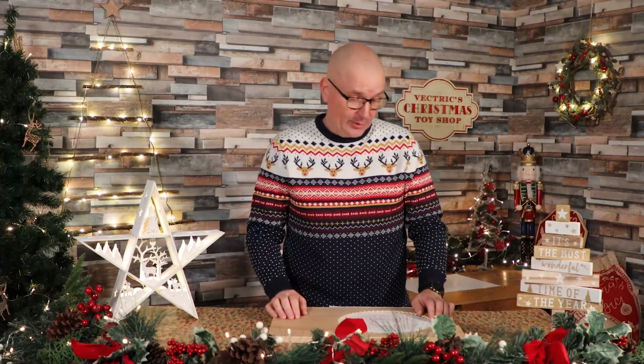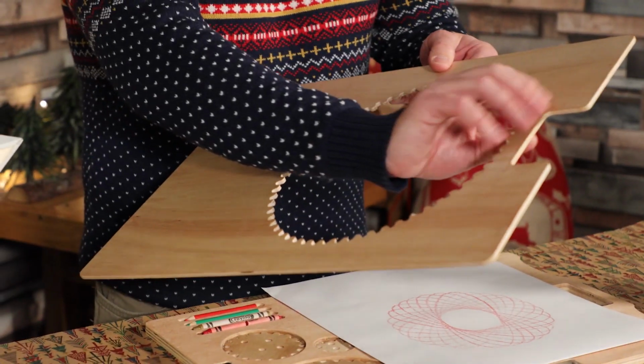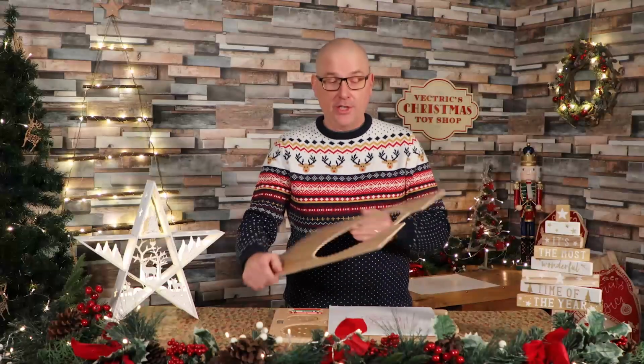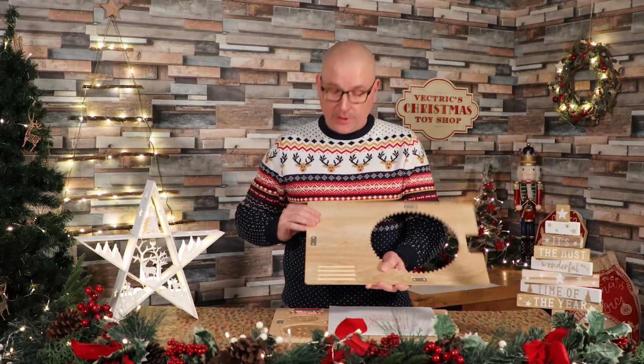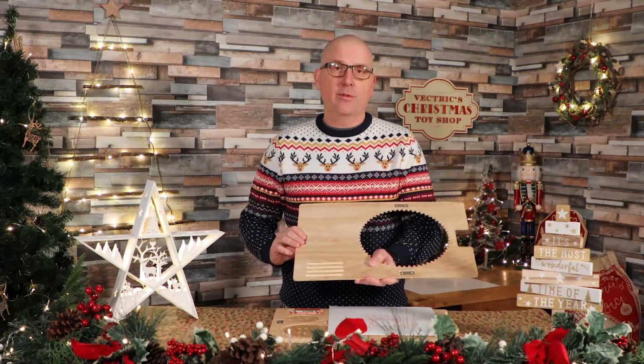Well, I had a lot of fun making that, and I learned a lot of stuff along the way. If I was ever going to make this again, a couple of things I would do differently would be I'd use a slightly thicker piece of plywood for the top of this. This was a bit thin and ended up warping a little bit, which was a shame. I'd also think of maybe finding a different way of affixing the top to the bottom. The magnets were a great idea, but I think I could rethink that and come up with a better solution for that.